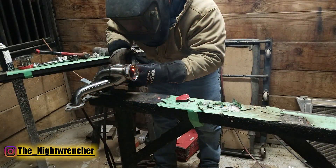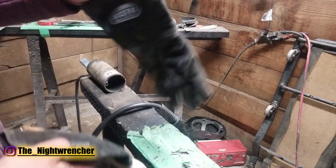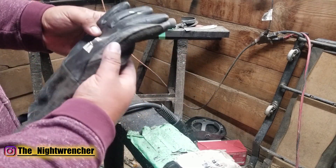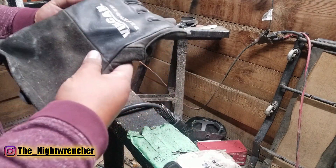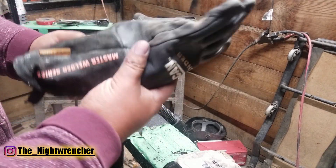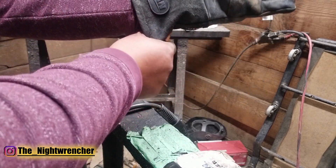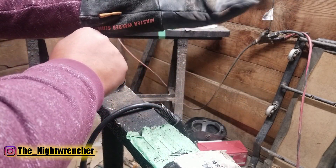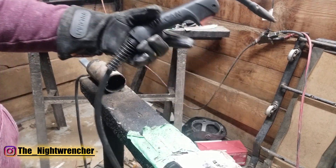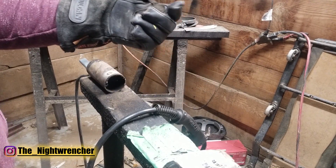Tip number three is something I realized pretty early on: I like to use two different types of gloves at the same time. This is the type of glove that the average person tends to buy — you can pick it up anywhere, Home Depot, Lowe's, whatever. It's a really thick, bulky glove. It resists a lot of heat and it's really tough, but the problem is that it's really hard to move in. Especially if you're holding on to your electrode, it becomes really difficult to actually actuate the trigger in a smooth motion.